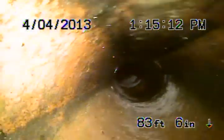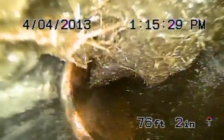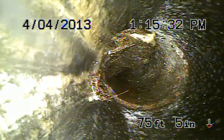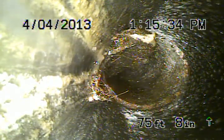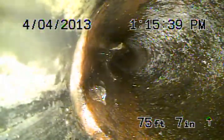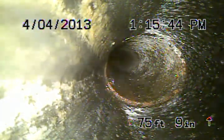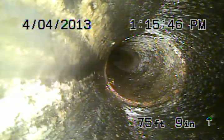All 4-inch clay pipe. On the property, it's still clay pipe. There's a little bit of clay — we're going to keep coming back. Still 4-inch. This is 4-inch clay. I did see a little root somewhere here — right here. So you can see this is the transition between the ABS plastic pipe and the 4-inch clay. You can see right here at the transition. I guess that was a loose root, or maybe I knocked it out with the camera.